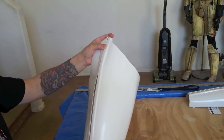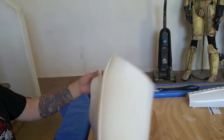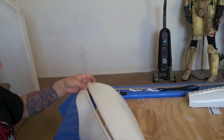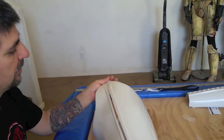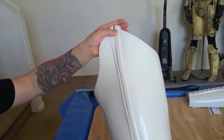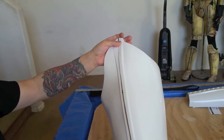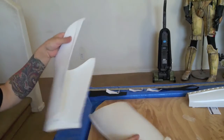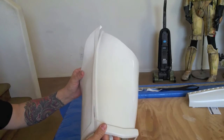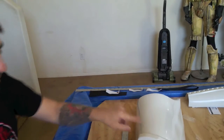The front, other than the very top, is done. I'm going to take it to the sander outside and sand it nice and smooth. They might not line up 100%, but once I put the inner shim in and glue the outer shim, I'll push these together so they're nice and straight. The outer strip is going to stop right here, so if there's a gap in between these two pieces you're going to really see it because there won't be a shim there to hide that. So now those two are done.